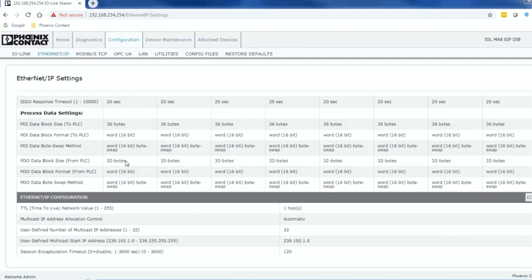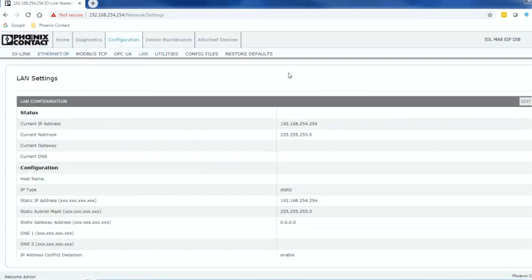The data can but does not have to be modified to more closely match the amount of data your IO-Link sensor supplies in its process data channel. But note, if you change the channel sizes, you're also adjusting the module's total produced and consumed size to the Ethernet IP master. For example, and for simplification, we're leaving all the settings at default.